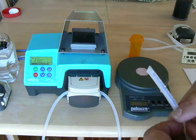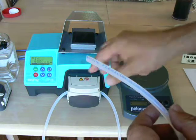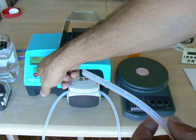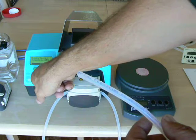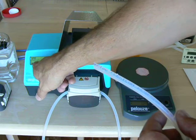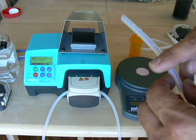That's a brief overview of the Watson-Marlow 323DZ pump. When you're finished, press the Stop key, pull up the menu, and use the arrow key to go to Exit. Hit Enter. It asks if you want to go to the main menu or restart the batch. Hit Enter at the main menu, and you're right back to the main menu with the four choices.